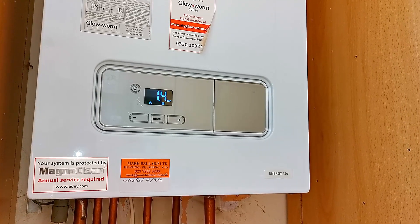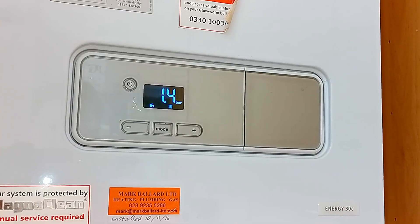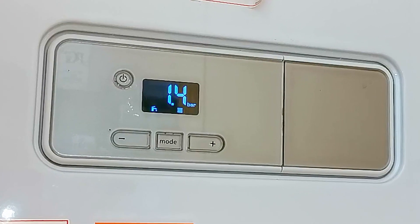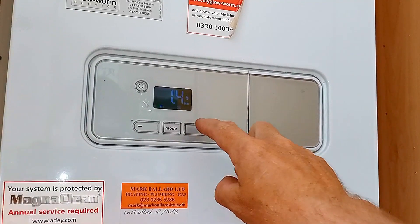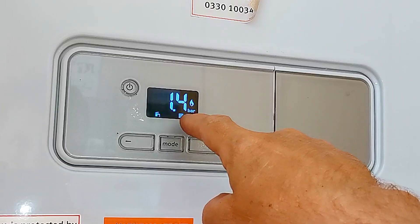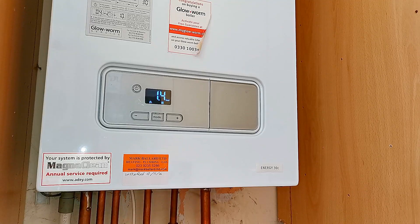The danger is that if you turn your hot tap on, the boiler still thinks it has water in it, so it's going to fire up and try to heat the boiler — but with no water in there, there's a possibility you're going to overheat or damage something. We can see the tap symbol is flashing and the flame is on, and the pressure is not really changing. To my ears the boiler is making some really horrible gurgly sounds — which other engineers will recognize as air being pumped around the boiler. This is incredibly bad for your boiler, so if you are getting this fault, get it sorted out sooner rather than later by a gas registered engineer.